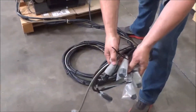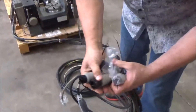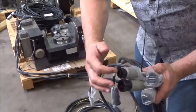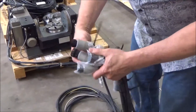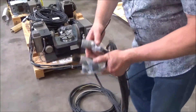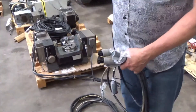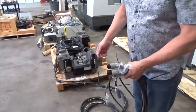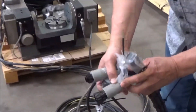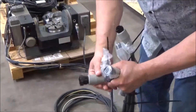Notice the collars on these are gray — this is the big-little cable pair. This is a two-axis trunnion, brushless, because we have big-little for each one: two cable interfaces for each drive. But there's a gray cowling here instead of being black. All the other cowlings were black — that means this has a sigma five motor. When we talked about brushless before with the black cowling, they were technically brushless sigma one. Sigma five came later and is indicated by the gray cowling. Two cables with gray cowling means brushless sigma five.